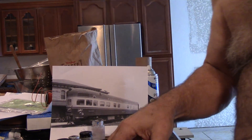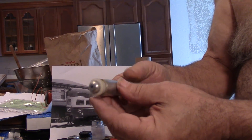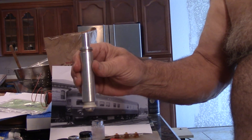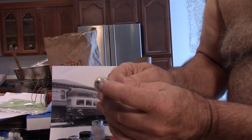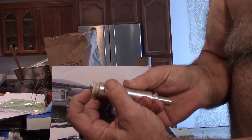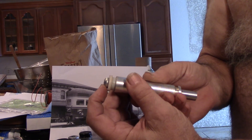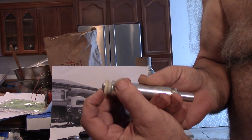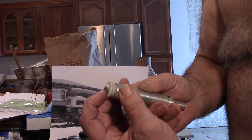I'm going to share with you a couple of tools. The first is a vinyl cutter that you can put in your CNC mill — you just chuck it up and then it'll follow your program. It's a little device that's spring-loaded, and the reason for that spring is to load the cutter on an uneven surface so you don't have to have it perfect. This moves a little over a quarter of an inch, so you load it, bring your quill down an eighth of an inch, and it's loaded — even if the surface is uneven, it will spring up and down and still make the cut.